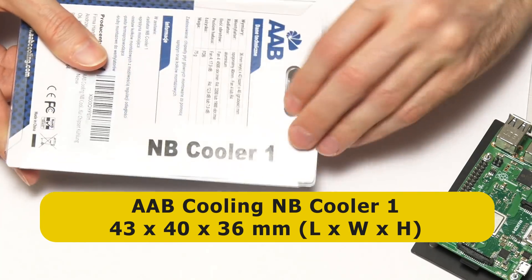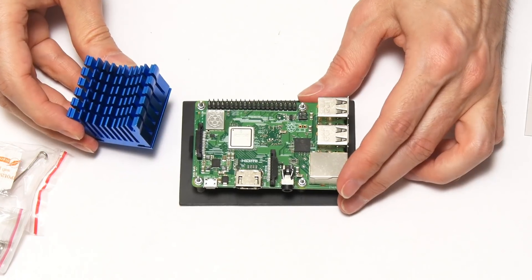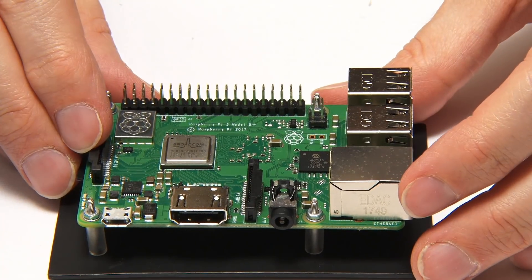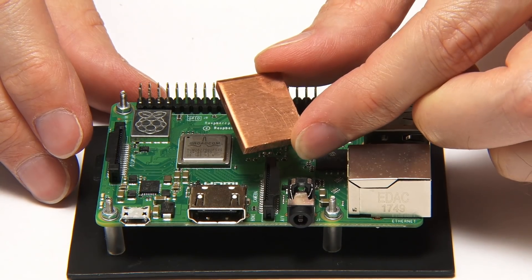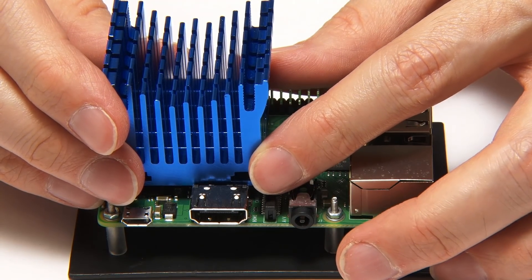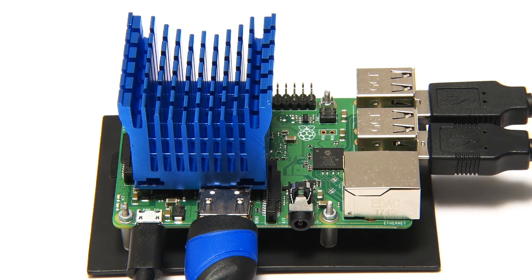To make this work, I'm going to use a piece of 3mm copper as a spacer. That will go on top of the system-on-chip, and then the heatsink will go on top of that. To have good thermal connectivity and to hold it in place initially, I'm going to use some Arctic Silver thermal compound, which will hold it together enough to see if the thing's going to work. So I'll get on with putting this together and repeat our cooling test.